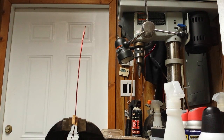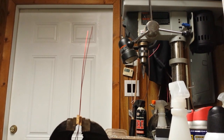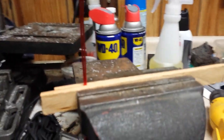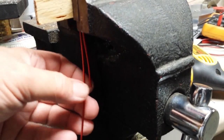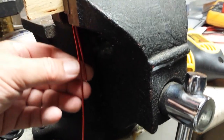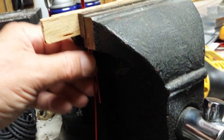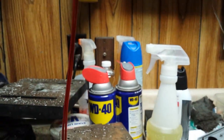We've got the wires set up here in the jig. Let me show you what I've done — a couple of pieces of scrap wood here to protect the wire from the jaws of the vise. This one, of course, will be your primary — the short one. I'm leaving a little bit extra here to connect to the coax. Then this will be your secondary, and then we're going to twist these.